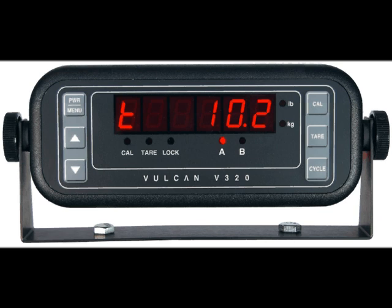Similarly, the net full load weight displayed by the meter should be within one ton when compared to the official platform scale net weight. For example, if the official platform scale weight is 10.2 tons, the Vulcan display meter should read between 9.2 and 11.2 tons. If the net weight reading is consistently in error by more than one ton, notify the scale technician for service.